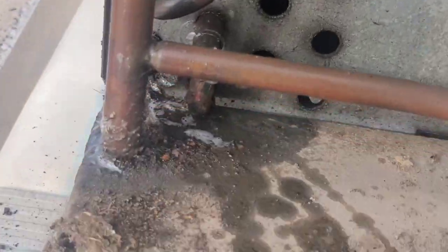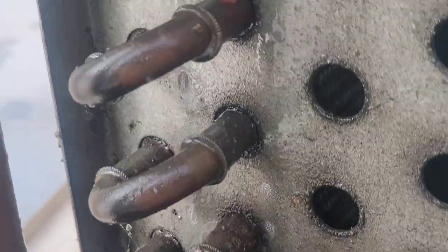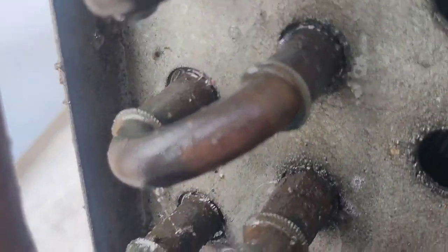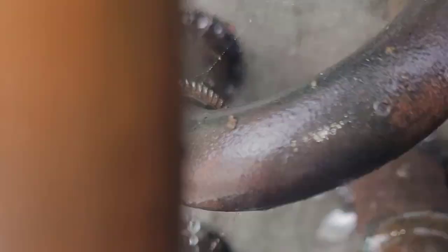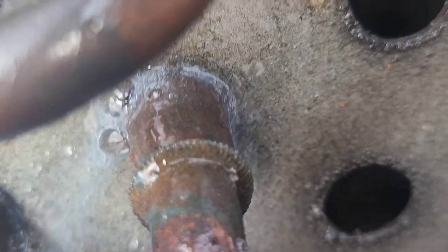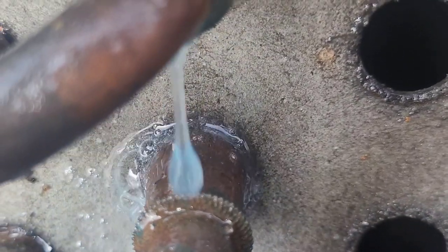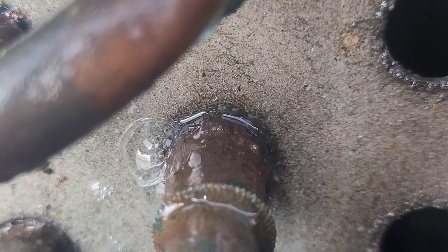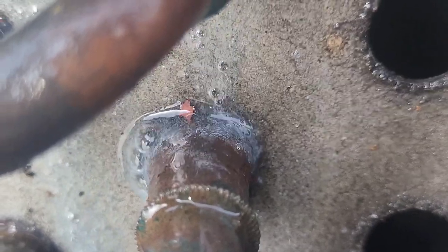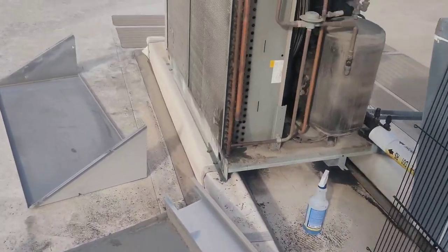So you have equal pressures - whatever little bit of refrigerant is left is equal on both sides so you can find your leak on the suction or the liquid side. This one is actually growing pretty quick - that bubble right there forming. That's considered a major leak when it forms that quickly. There it is - major leak. Under EPA rules now you can't leave a leak.